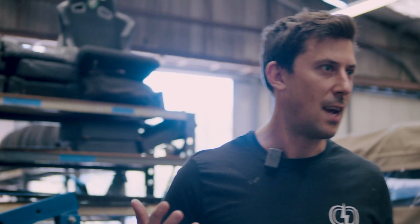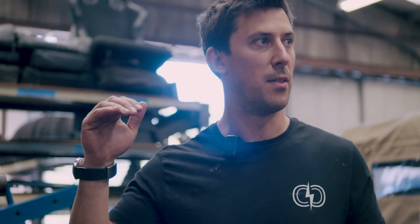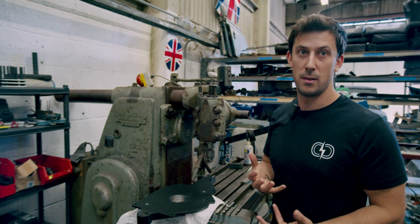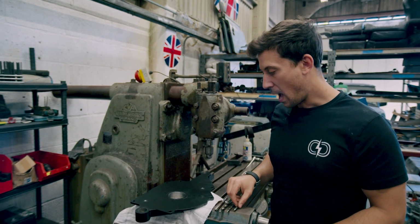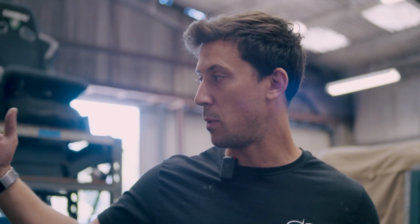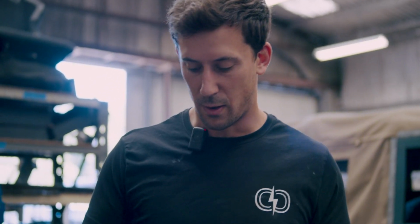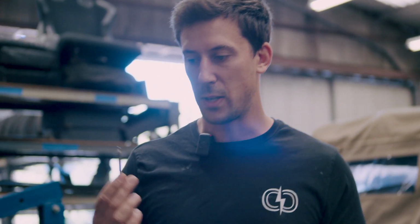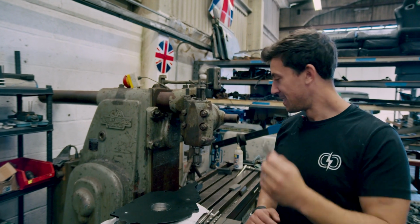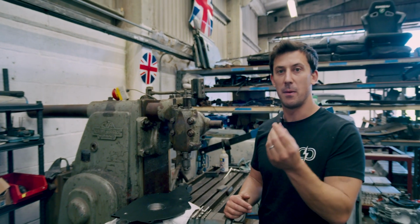It being a mill, we're not actually using it as a mill, we're not doing the positioning, we're letting the imprint of the center punch guide the tools, but the mill is actually here to give us the stability. Basically the steps we went through were, once we've got our piece set on the bed of the mill, the first thing you always do if you're drilling an accurate hole is to use a centre drill bit. And this will really accurately follow the imprint left by the centre punch.